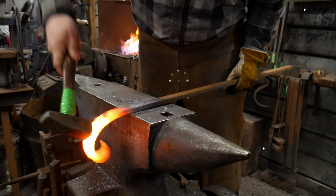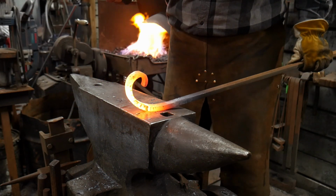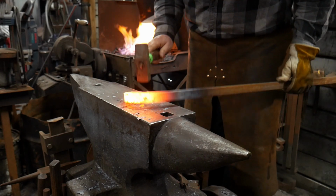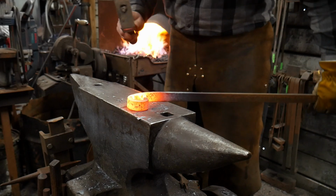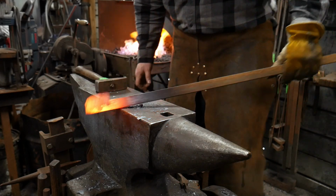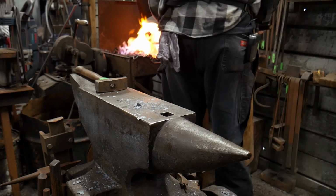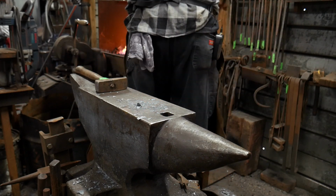And that's gonna start our scroll looking really nice. The other secret about scrolls or doing scroll jigs, you do not want to do too much at once. Don't get carried away, because that's when you accomplish nothing but flat spots. We don't want any flat spots in the scroll. We want it to be one nice smooth spiral.